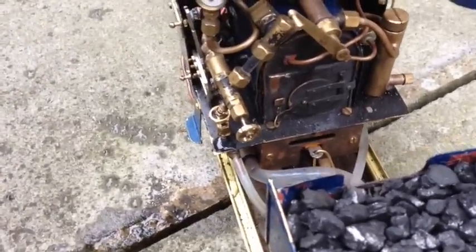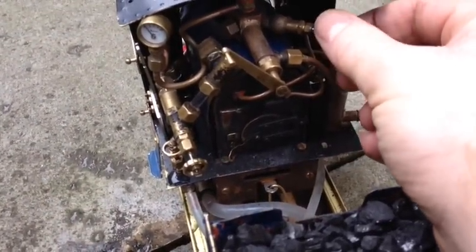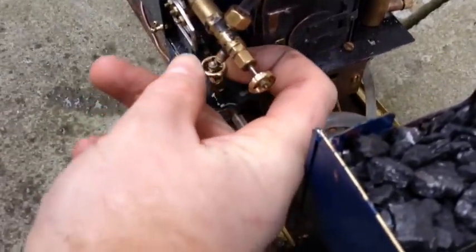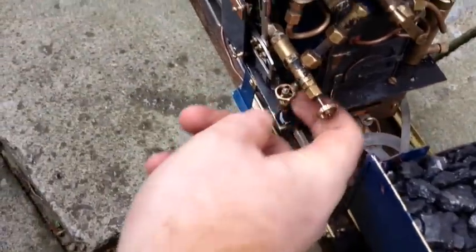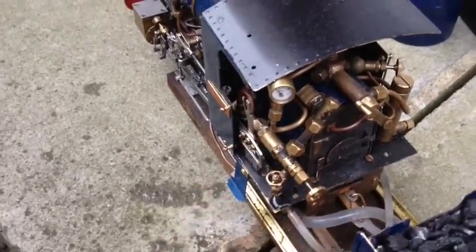The controls that may not be too familiar are the blower valve. This valve is for creating a draft when the engine is in steam to keep the fire nice and hot. This is what we call a bypass valve because there is an axle pump between the frames running off the axles, and it pumps continuously. What this valve does is either close off the feed back into the tender, which will then pump water into the boiler. However, if you open it then the water will just pump into the tender.